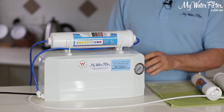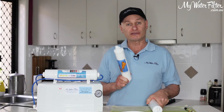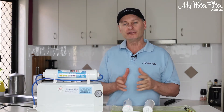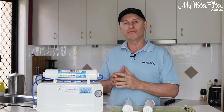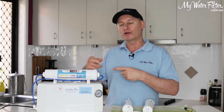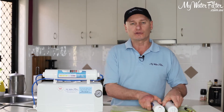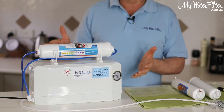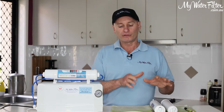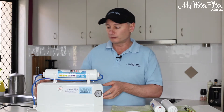Inside, they're all the same. Annually, we normally change two cartridges. We change a sediment cartridge in position one, and we change a cartridge that's carbon, and it's in position two and four. We keep one, dispose of one, and rotate them. So I just want to go through that with you now. Basically, a nice little water filter — probably about 90 odd dollars a year for the cartridges to be replaced in this system, and it's a pretty simple situation.